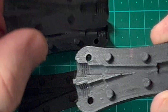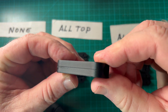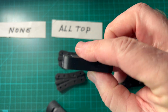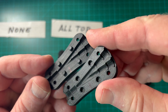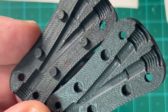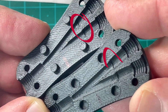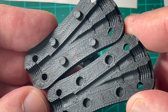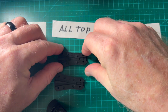When we put the two halves together, it snaps right in — no lines or gaps, so it's a good print overall. But on the inside of the channel there are little surface details that we probably don't want, because they'll cause friction when running PTFE tubing through and cause excessive wear. That's what we get with no ironing.